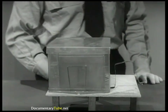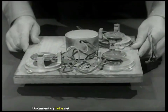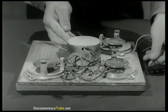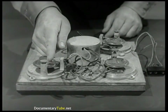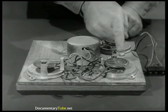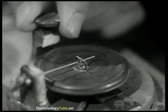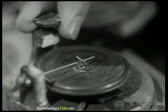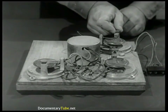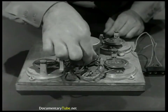The aneroid plate is now taken out. These are the aneroid barometers. The master aneroid is in the center of the board. The four aneroids are connected to the battery by wire leads. This aneroid is set for about 27,000 feet; the setting can be adjusted by turning this screw. This one is set for about 20,000 feet and works on a straight make-and-break contact, and can also be adjusted. This one is set for between 13,000 and 20,000 feet and controls only the payload. The master aneroid, covered with a cap, controls the dropping of the ballast. Unlike the other three, it does not close the circuit at a fixed altitude, but only when a preset pressure decrease occurs.